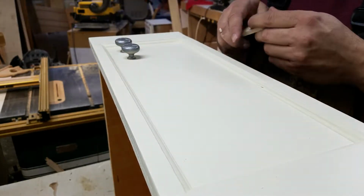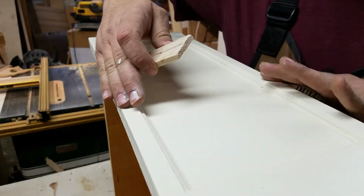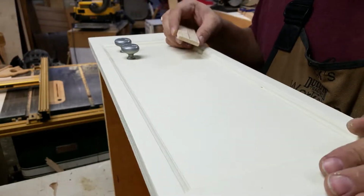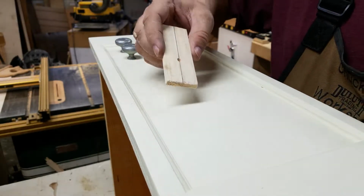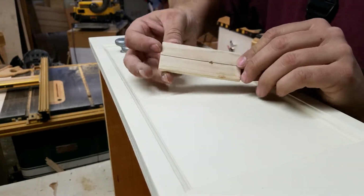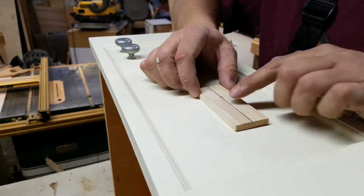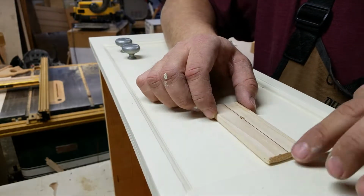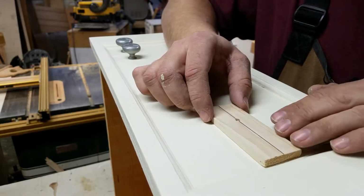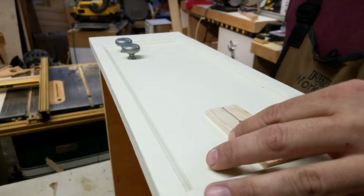Each drawer is a little bit different. I think two of them are almost identical, but one of them is definitely a little narrower, shallower. So in order to position the knob, where I'm going to drill the hole, I made this real quick little jig. It just has a line on it. I just line it up. I marked the center here. You can't see it from the camera, but I marked a real small light mark so I could position that and drill my hole.